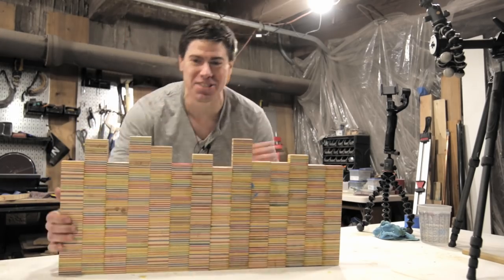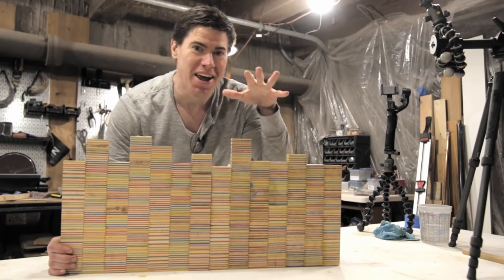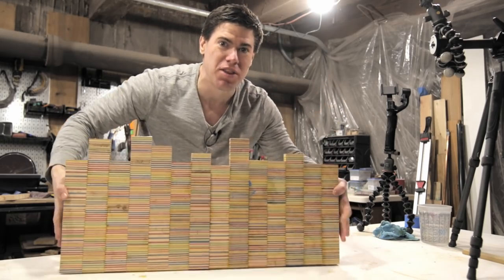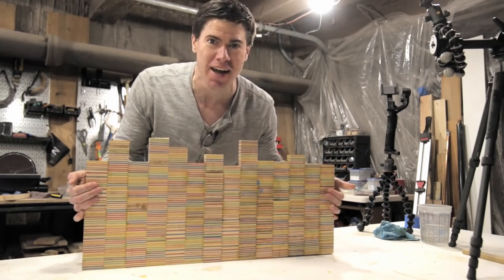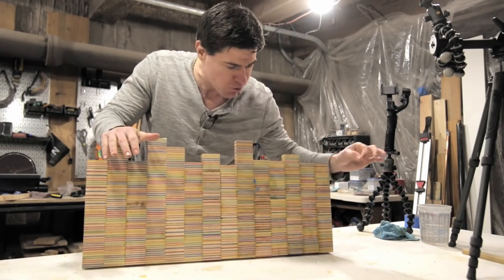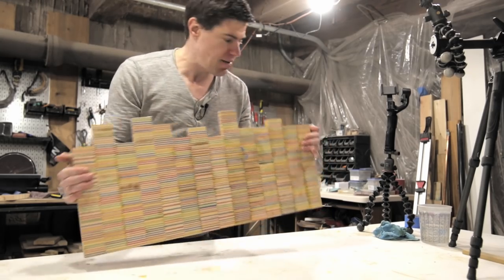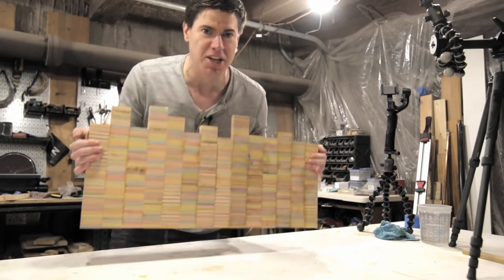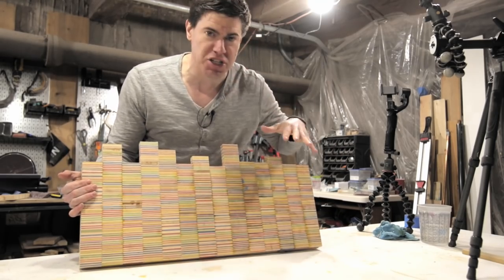I'm getting kind of excited about how this is turning out. The guys at Focus Skateboards told me I have to put this through the planer running with the plies of the wood — if I don't do that it could actually be a really big safety issue. Before we go to the planer, we're going to take this to the table saw, where the MDF now gives us nice straight edges to cut against, so we can cut a 26 by 10 front sheet out of this.